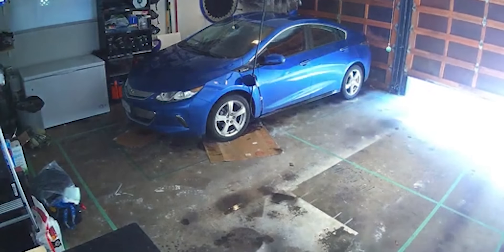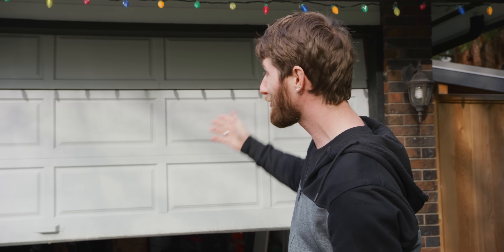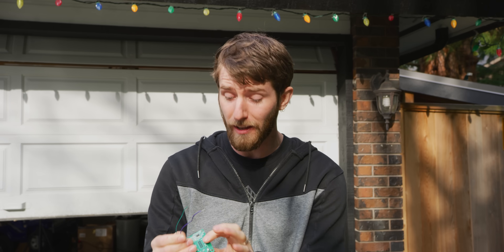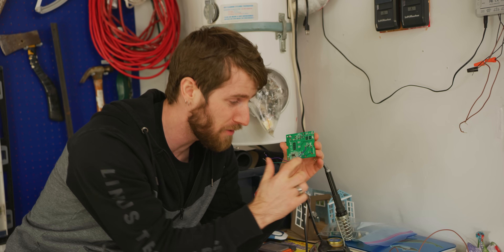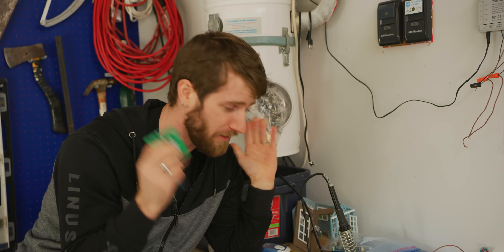Too bad the system worked too well. I sent this video over to Mehdi from ElectroBoom showing that while my Google Voice Assistant commands to open and close the door did work with my soldered leads, unfortunately the garage door would also just randomly activate itself. He explained it's something to do with analog circuitry and a very high level of sensitivity to electromagnetic interference — essentially, the wires coming off the switch were acting as antennas and triggering it, sometimes repeatedly in the middle of the night. That's a bit of a security problem. With guidance from Mehdi, I salvaged some capacitors and resistors from a donor board and attempted to put some filtering on the circuit, but after spending an entire afternoon on it, I thought: enough's enough.